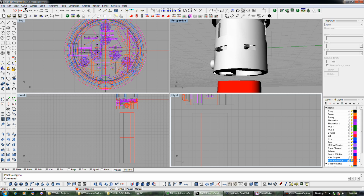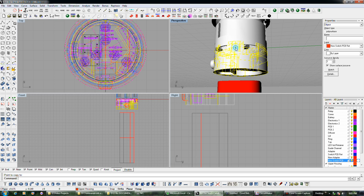Otherwise, I need something to give me a visual alignment cue. If there's no capture mechanism like I have between these two parts, with that little capture lip, it would have to go on the outside of it. But again, since the top of this, being the first layer of the next part we're going to do, has to be flat, I'd have to start immediately flaring out from here and then go down. But I guess I could probably do that. That's probably not too big of a problem. I've printed parts like that before.